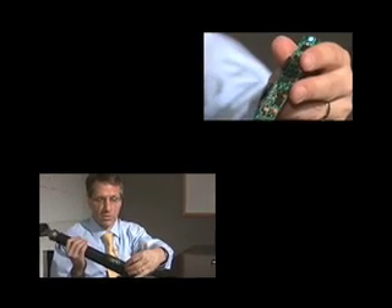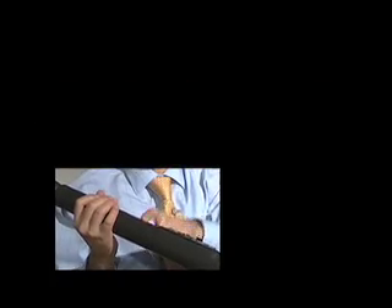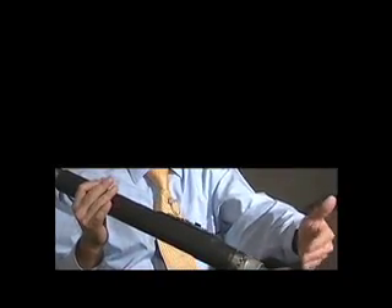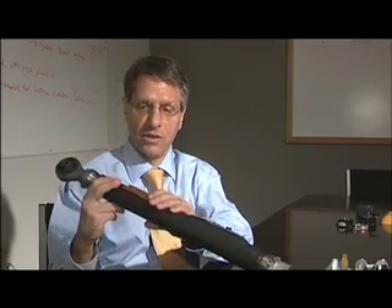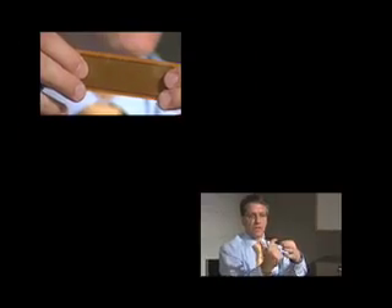How do we do this? There's a board — we call it the pitch link board — it lives underneath all this protective covering. Attached to the pitch link are strain gauges set up to measure the tension and compressive loads that this thing sees. This piece here is a piezoelectric material — 'piezo' means stress in Greek. When the link sees cyclic strains, that generates power. Inside are lots of little fibers running along the length of this, and when we apply tension, those fibers have a polarization that creates voltage when stressed.